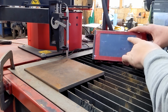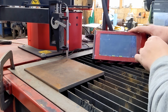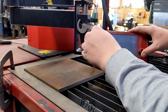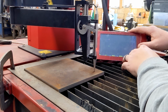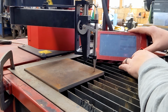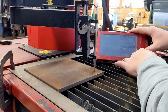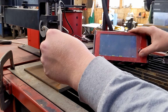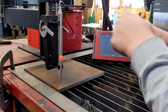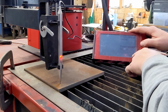We need another 3/4 inch hole. Adjust this to center cut because I want it slightly oversized. With center cut, in my experience, you get about a 1/16 inch oversize. Center cut. And another 3/4 inch hole, center cut.